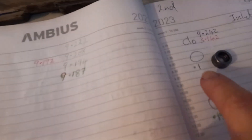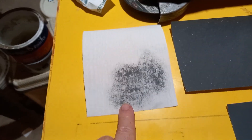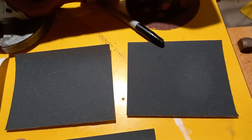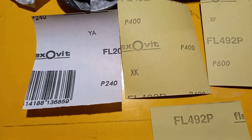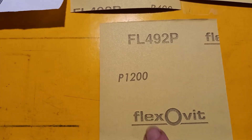That should give us 0.15 clearance here. We started with 240 grit, then 400 grit, 600 grit — did that about three or four times — and then the last pass was 1200 grit. So: 240, 400, 600, 1200.